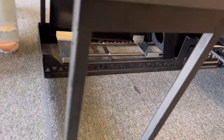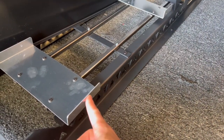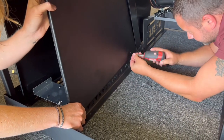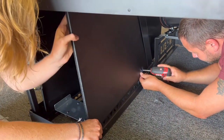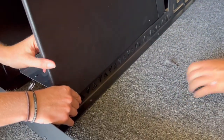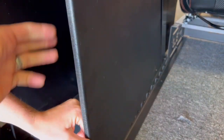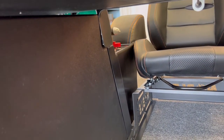The same process goes for the last skin on the other side — the aluminum pieces are already tapped. Get the two holes lined up, easier with an assistant supporting the back. Find the hole and do the same thing in the back. For the corner screw, again have somebody reach in to supply counter pressure so that when you're putting that screw in, you have something to push against.